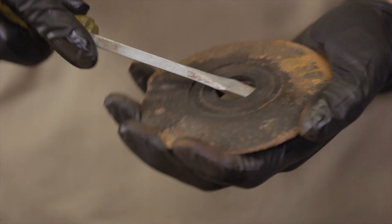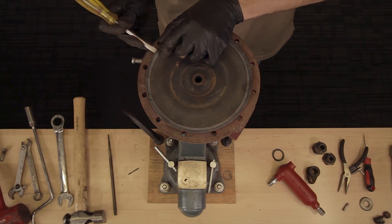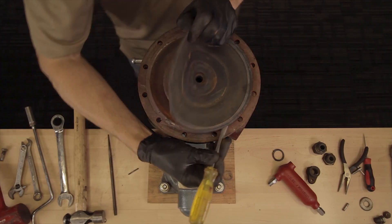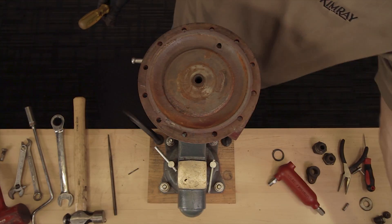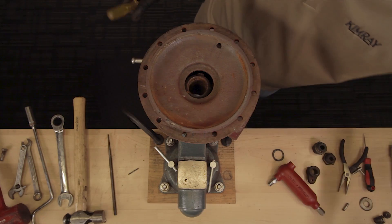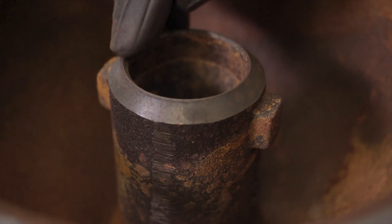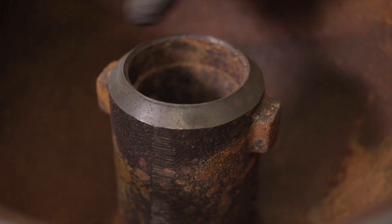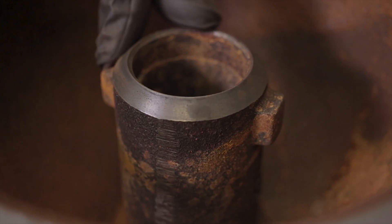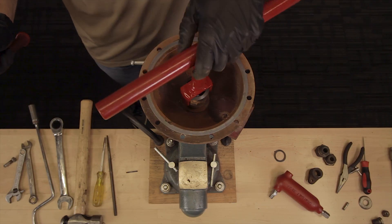You'll need to use a flat head screwdriver to pry out the seat if you have the old style valve. If it's a newer style, it will come right out. Remove the diaphragm, then the diaphragm plate. Inspect the removable seat — it's ideal if you don't have to remove this. However, if you spot damage or a potential leak path, removal is necessary.